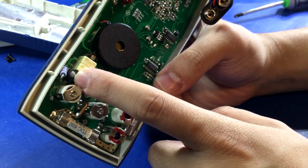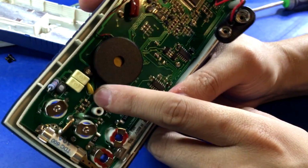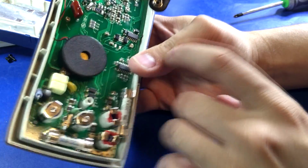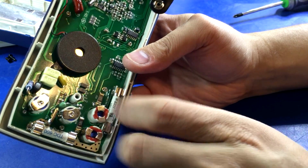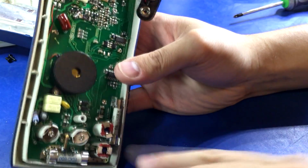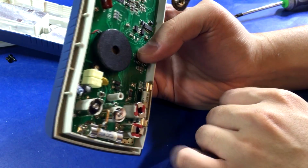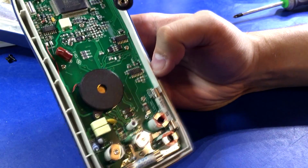looks like a single wimpy PTC. It does have a varistor right here, which is cool. It's what, only the second one now that's had one, so that's awesome. Both ceramic fuses, and nice wide traces for the 10 amp one. The input jacks, these look like the solid type, these look like the split type, but these are the current ones, so maybe these have input detection alert. So that might be why that's like that, but all in all, it's not honestly that bad.